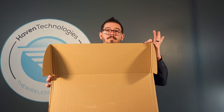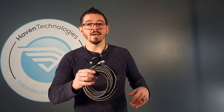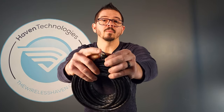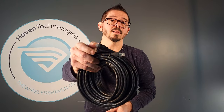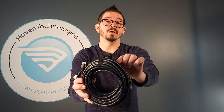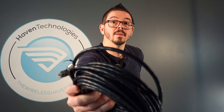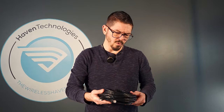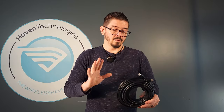When you get your QuadLink antenna, you'll get a big box. Inside you should have 50 feet of outdoor-rated Ethernet cable — shielded, with solid 23 AWG solid copper — Category 6 cable, plenty for up to even 10 gigabits, more than you'll need.